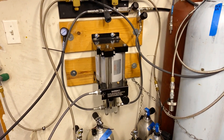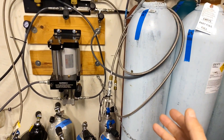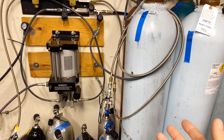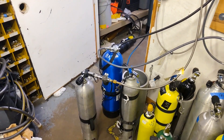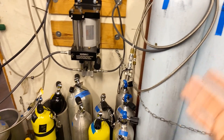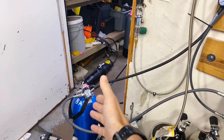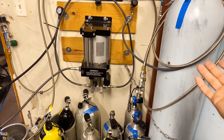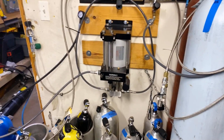Booster 101 — what's the idea and purpose? The idea of a booster is: I have supply cylinders anywhere from 2400 all the way down to 300 PSI of O2, argon, or helium, and I'm trying to fill my smaller cylinder up above what those supply cylinders are actually filled to. So this booster is going to take air as a drive gas and take our lower pressure gas — in this scenario, oxygen — and get it up above what that cylinder is at.